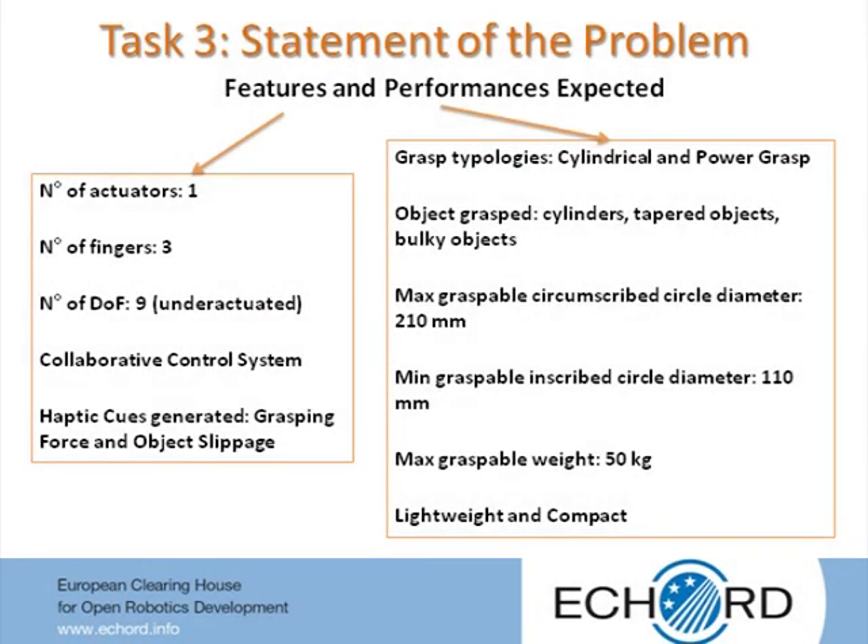A highly underactuated flexible haptic gripper can allow the grasping of loads having very different and complex shapes, able to be intuitively and effectively commanded by the operator's hand on the basis of suitable haptic cues correlated to grasping variables: grasping force and object slippage. An underactuated approach enables the self-adaptation of the fingers to the object's shape. As a consequence, the body extender gripper has been provided with 9 degrees of freedom powered by only one motor. Compared to a fully actuated device with one motor per degree of freedom, this design solution presents advantages such as reduction of hardware and software complexity, device weight, and is more compliant to the object during the pre-grasping phase while stable and stiff after the grasp has been obtained.